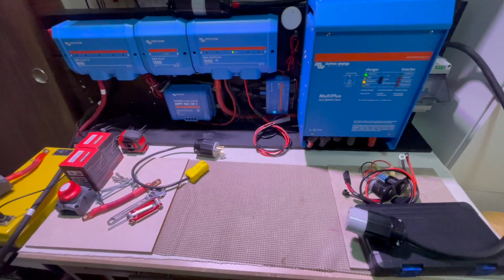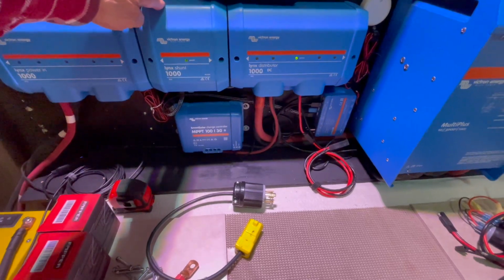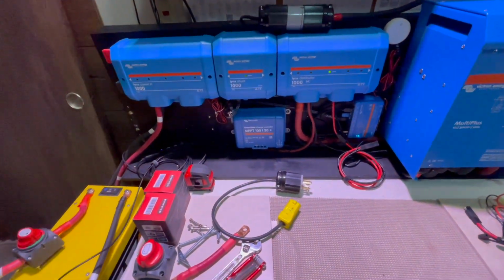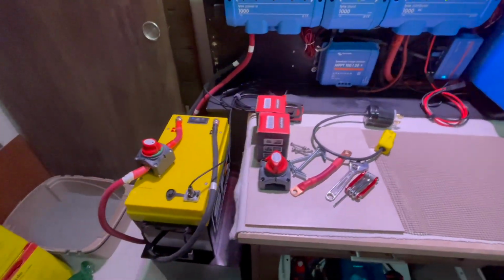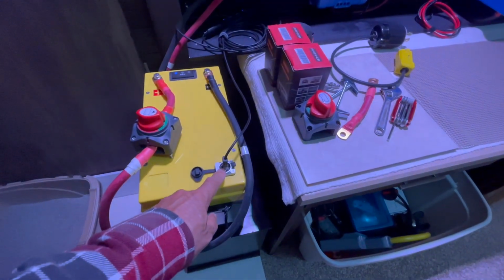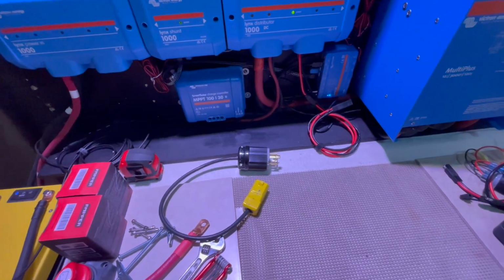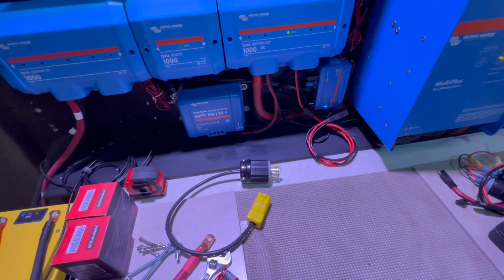Okay, one more thing I was going to talk about. Right now I am using, well, no, actually, I was using my Lynx shunt. I have a third-party BMS that will control my system. And in this case, I'm using the SimplyOffGridLife 300HP. Notice this little cable plugged in, plugs into my Cerbo GX. My SimplyOffGridLife kit controls the charging and discharging, the way I have it set up.